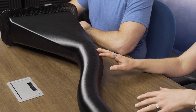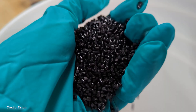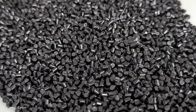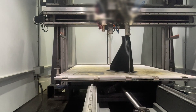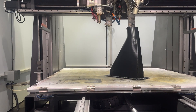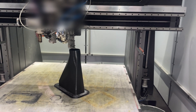Getting the material right — in fact inventing a new material — was necessary to start printing air ducts suitable for aircraft. But there were things to work out on the 3D printing side as well. This project started with a printer that cost about $1,000, but at a certain point they needed something more repeatable, more reliable, and a lot bigger. This air duct was made on a Titan pellet 3D printer from 3D Systems. They specifically chose the pellet printer because you can directly print with pellets — it's lower cost, faster, and less processing on the raw material side is needed. Pellet printing also allows for large build volumes that SLS or FDM may not support, and you can move a lot more material through on a per-hour basis.